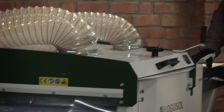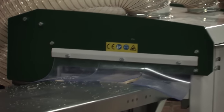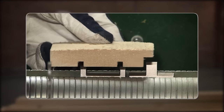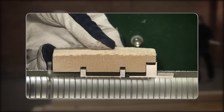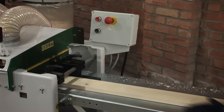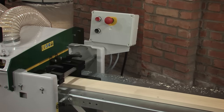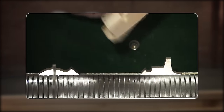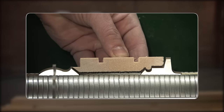This also means that you can machine both dry and wet timber with excellent feeding function. The SH410 is now set up for producing panelling. First, the back of the panelling is machined — dimensioning and moulding in one operation. The front is shaped with moulding knives for beaded tongue and groove.